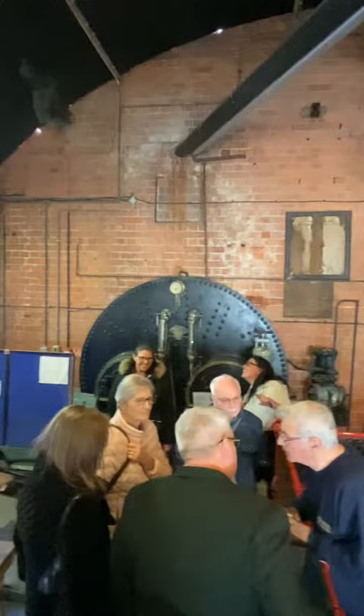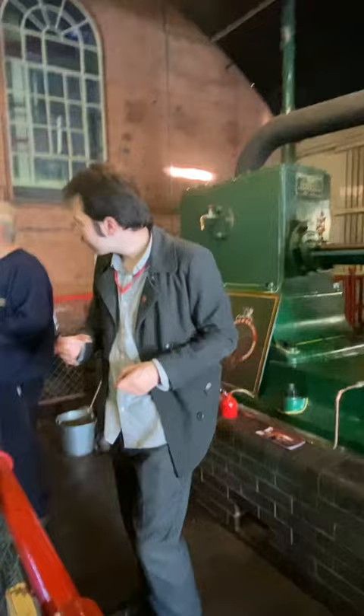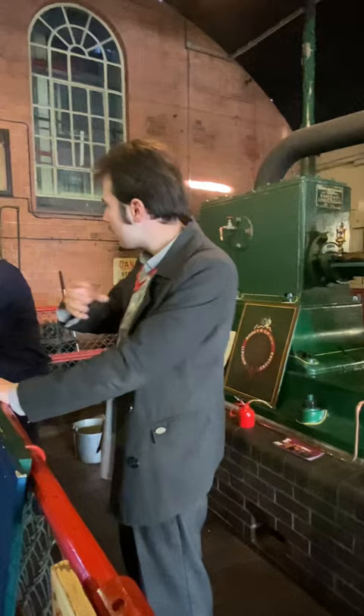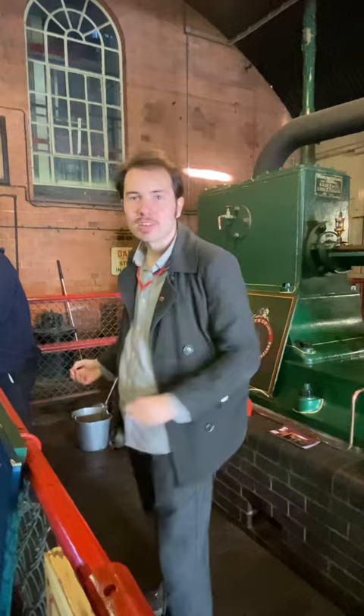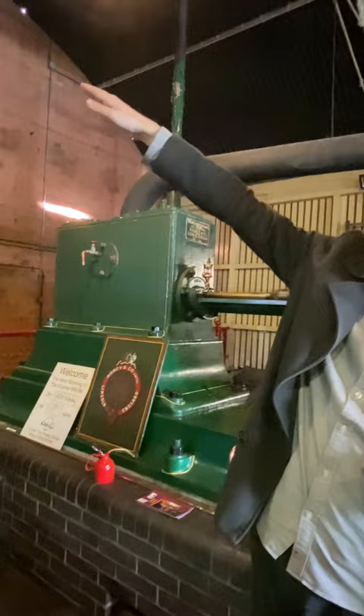We start with the front panel of a Lancashire boiler — and I say front panel because they're actually 30 feet long and about the height of this room, holding about 30,000 litres of water. Behind each door is a firebox, four feet wide and six feet tall. As the air travels around the fire it gets incredibly hot — about 400 to 600 degrees Celsius in there. That hot gas travels down the boiler and transfers heat energy to the surrounding water, just like a giant kettle. But we keep it contained to get high pressure steam, and it's that pressure which stores the energy. Steam comes out the top of the boiler at about 100 pounds per square inch — 100 PSI — and comes along the pipe into the engine.